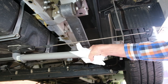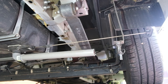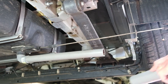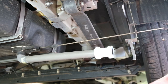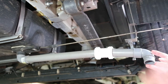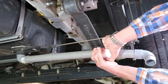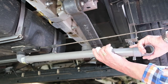Then we're going to use a 40 millimeter compression coupling to join the two parts back together again. The chassis pipe is not a UK standard so it's slightly smaller than UK spec, but the compression fitting will cope with that — it'll tighten up and seal perfectly well. What you'll find is that the pipe is a bit floppy, not very rigid, but it does allow you to twist it.